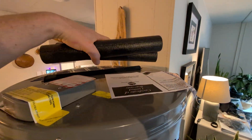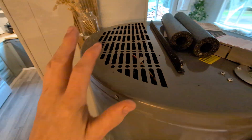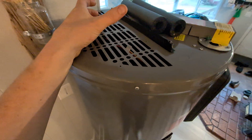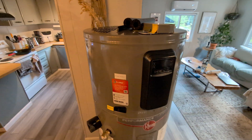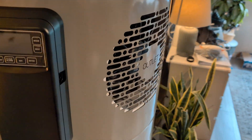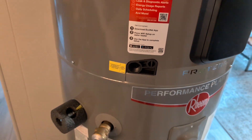It came with these two short sections of insulation. There's an outlet here and an inlet here. You can buy adapters that sit over the top so you can get ideally moist warm air into it, and what comes out is cold dry air, because there's a condensate line coming out that will get rid of moisture from the air.